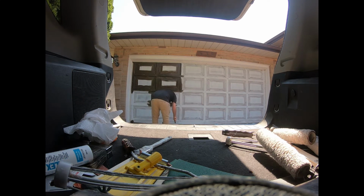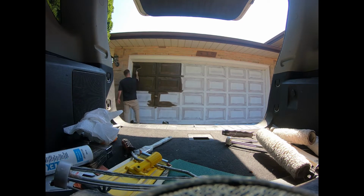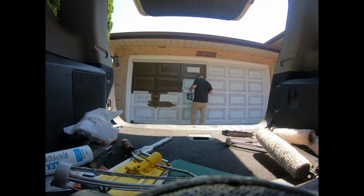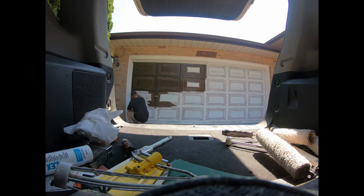And also it's just nice not working in direct sun, especially when it's like 25, 26, 27 degrees. That is the other thing. When I did this door, I made sure it was about mid-20s. Depending on where you live, there'll be a range of temperatures. Here, though, I find 25 to, say, 27, 28, if it's not super humid, is the best time to apply the exterior paint.